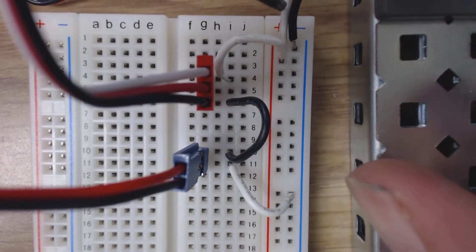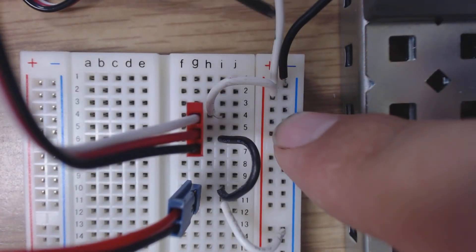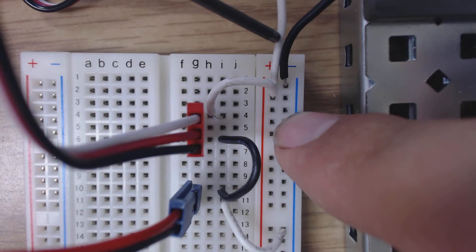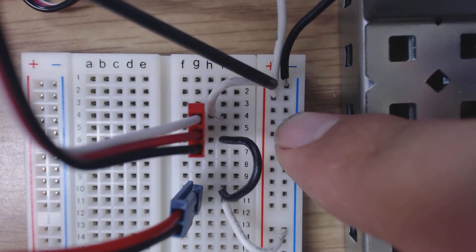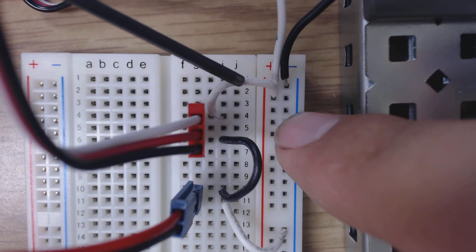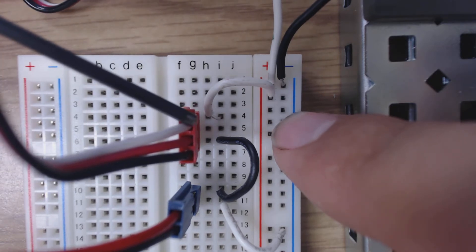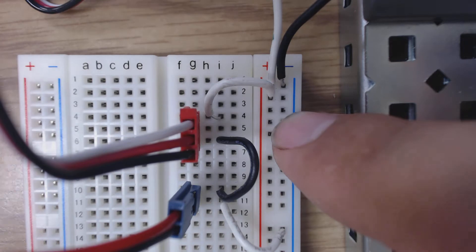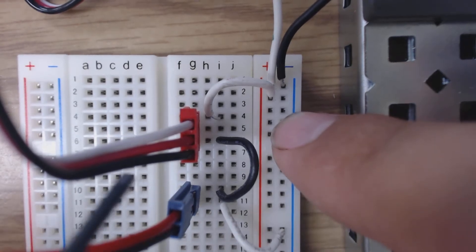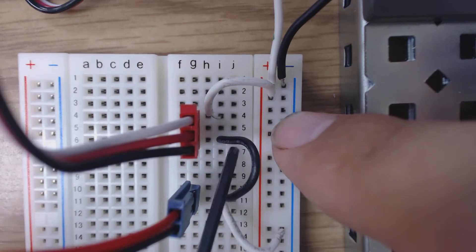First, just so you're aware, I don't have any red wire — everything's white or black. So I'm coming in on this white wire; that's my power supply setup right there. From there, I pick it up with this little white jumper wire and I take it into the switch — the little VEX button, that's what we're using on this project. I pick it up on this white wire, it runs through the switch, and when the switch is closed, it comes back on this black wire, which sends it to row 6.